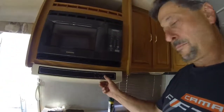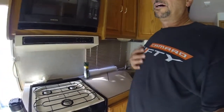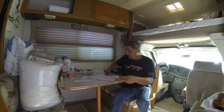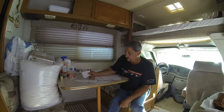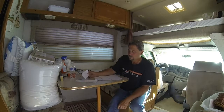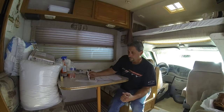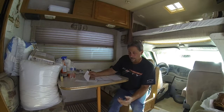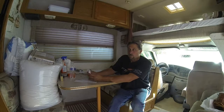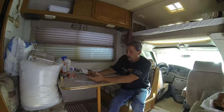Here's what's going on. I don't have power to my generator from the inside — I can't start it or stop it, and likewise I can't do anything on the outside. So I went to this website called www.flightsystems.com and looked up what's called an RV generator troubleshooting guide. I went through this guide and eliminated the voltage regulator being bad, so the only other thing that could be bad is the brain. I did some tests using the troubleshooting guide and figured out that the actual engine control module — I'm going to call it the brain from here on out — is not working. Must have fried the brain.